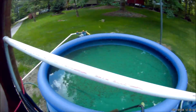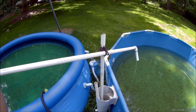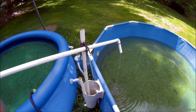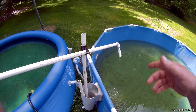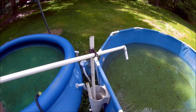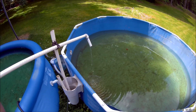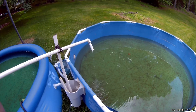The PVC delivery pipe comes all the way up here — I had to go underneath the road — and comes up to right here where I've got two pools. When it's operating properly I can fill one of these pools in less than two days. I'm getting about 20 gallons an hour; when I did my test I was getting 30 gallons an hour, but I'm running hundreds and hundreds of feet from the source, so that's not bad.